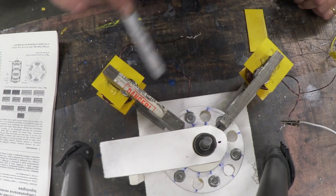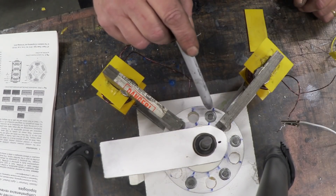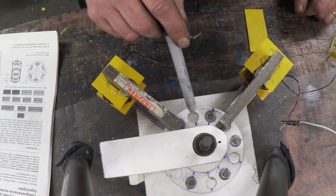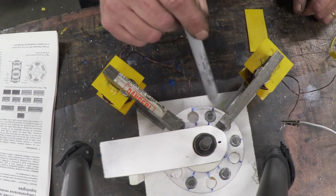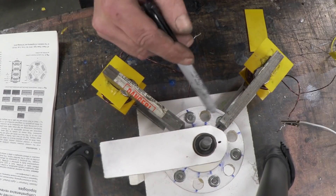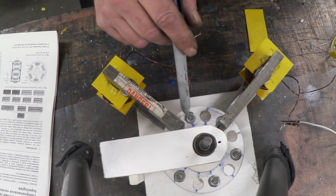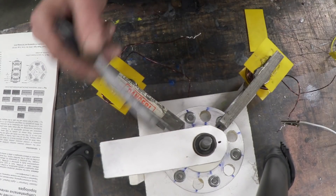I've got the two C's that I was talking about, and here what we've got is a plastic rotor with these bits of metal. These bits of metal are actually just a stack of washers — I'll talk about that in a minute. Now the C is midpoint between two bits of metal, and if I give that a pulse of power, that's what you'd expect it to do: it spins around so that the metal lies underneath the C, but it also moves this section of the rotor. So now this C is midpoint between these two metal bits.